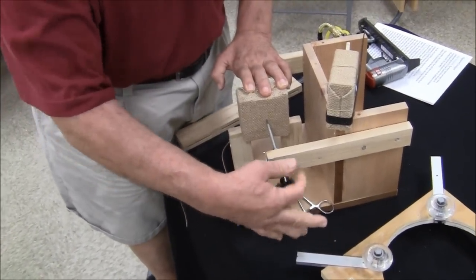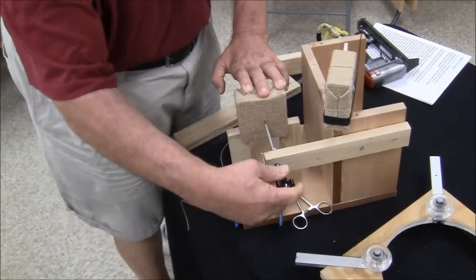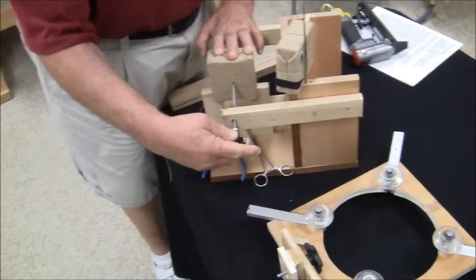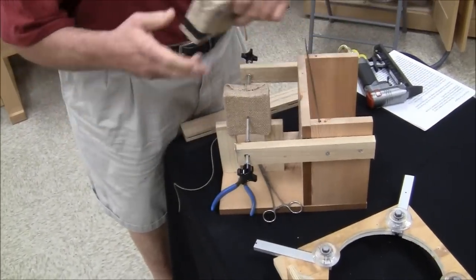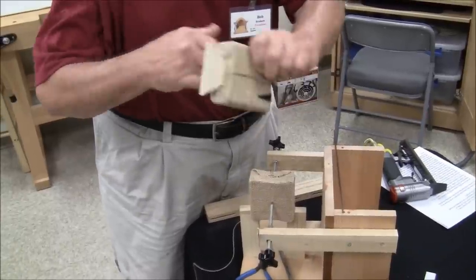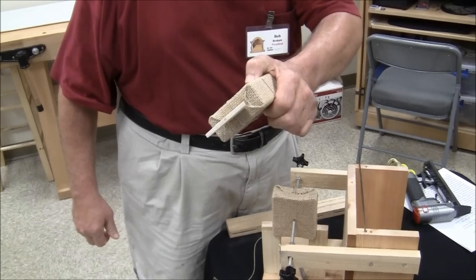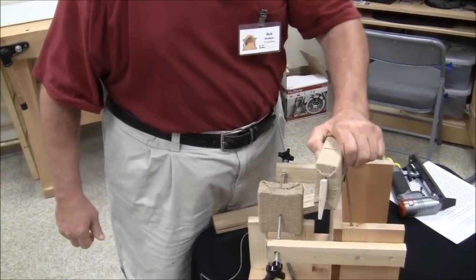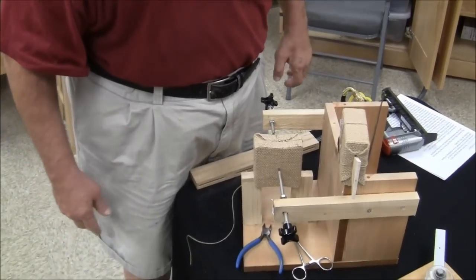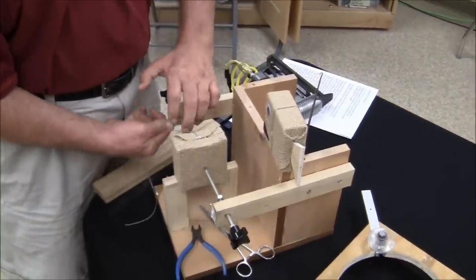What this contraption does is I spear this thing. The way I made it for the first iteration was I had a fixture that you'd set this thing in place and it would locate the intersection points for this string tie. And I would put a couple of nails in there. So that took quite a bit of time to flip that thing over and over and grab it. And then you had to remove the nails afterwards. And it was just really slow.